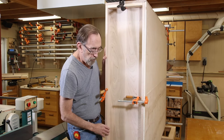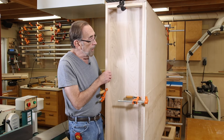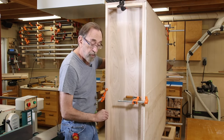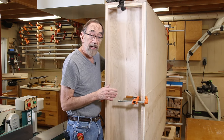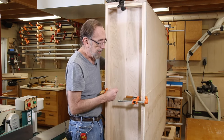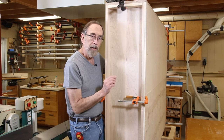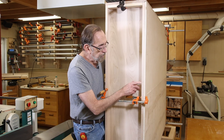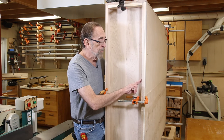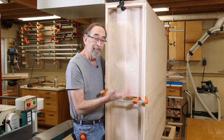I've got the pieces cut out for the base reinforcement — they're just clamped lightly into place right now. I'm adding reinforcement next to the back, next to the two ends, and across the front. If anybody ever decides to drag this big giant bookcase across the floor, it'll have a lot more strength to resist tearing up. Once these perimeter pieces are glued in, I'm going to put a couple of cross braces across here as well. I've cut those just a smidge narrower so they don't come right to the bottom — if someone moves this bookcase, there'll be a little less resistance to sliding on the floor. Ready to glue up.